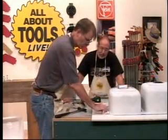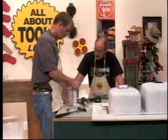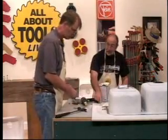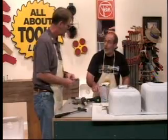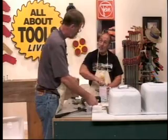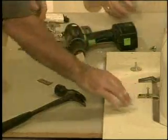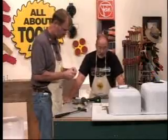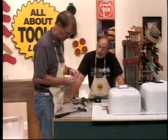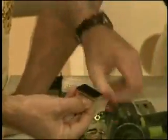What you want to do is just clean the area really well where it's going to be applied with denatured alcohol. Now, if this were stone, and you can use these on stone or quartz, it's a different epoxy. If this were stone, I would take a wire brush and lightly scuff that area to make sure there's nothing loose, then wash it off. Then once that's done, you just take this little backing and peel it up like that.